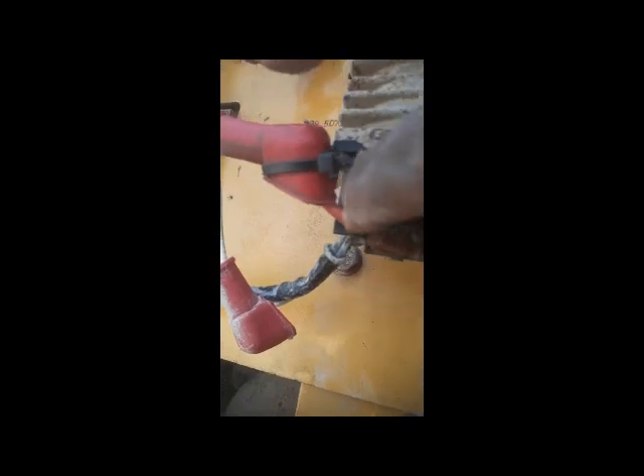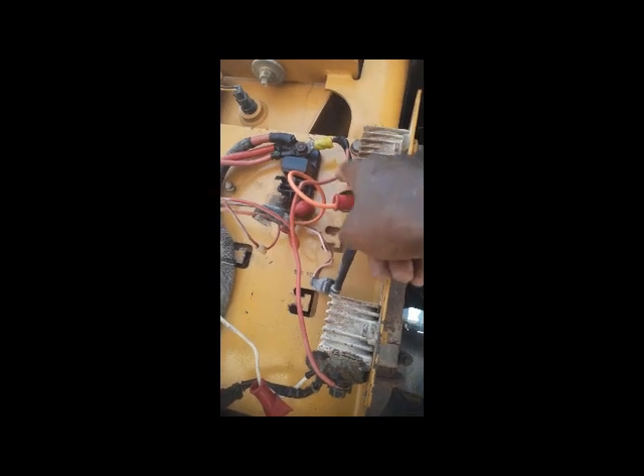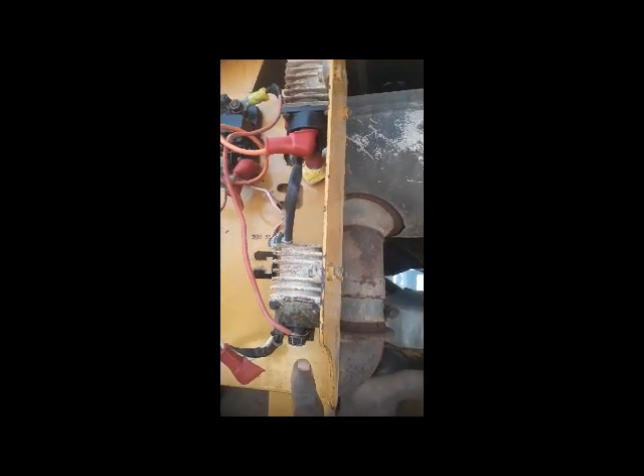If this cable has power and these two wires energize this relay, then after energizing, power shifts to the other side and this white cable starts the motor. I will find where power is not coming. As you can see I have cleaned this area, changed the nut, and also moved this wire to another place because the other side was broken — so I fixed it.